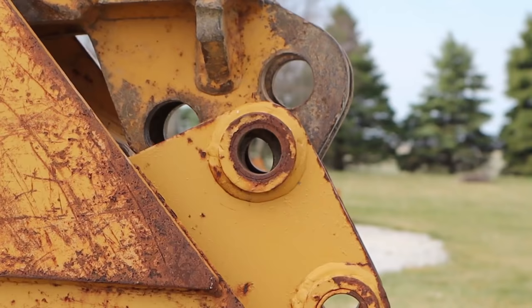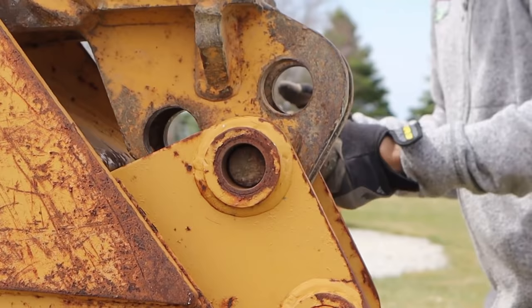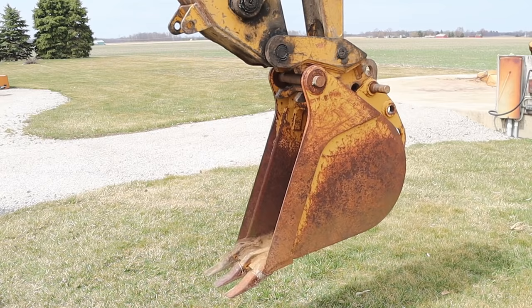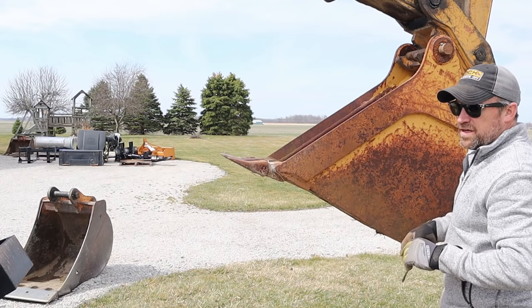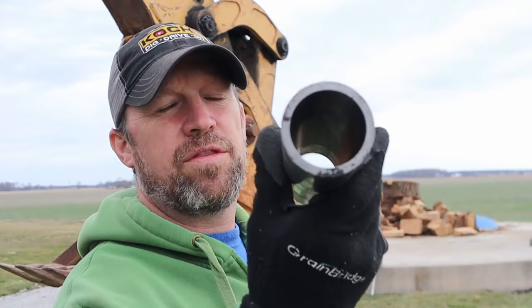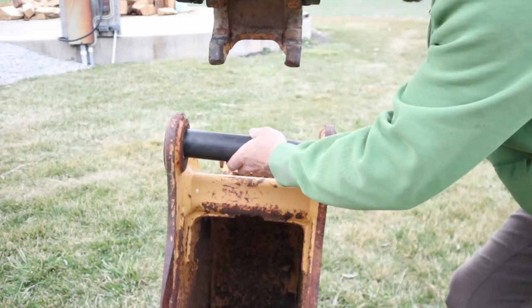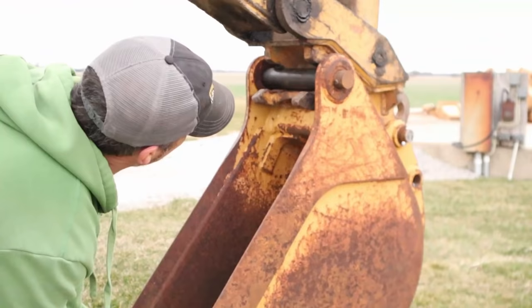It's really close. I think that's gonna work. I just need to find a bushing that is an inch and a quarter — inch and three-quarter ID, two and an eighth inch OD — and that will make that pin the same size. I ran out during lunch and grabbed this piece of pipe from the metal store. Now that I can cover up the rust, it took a good bit of the slop out of it.